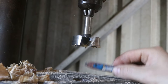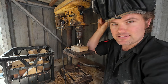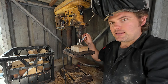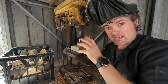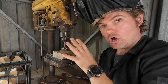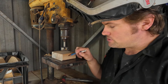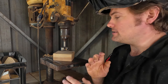We're over at the drill press now and this is a 50mm Forstner bit. I use this little spur to identify where the center is - where I need to get it smack bang in where I made that little mark with the template earlier on. One thing I want to quickly mention: I'm making a mortise with this Forstner bit to go on the VM90 chuck - the Vicmark chuck with the dovetail jaws. When you're chopping your blanks up, always look for faults where little cracks might be running up and down. When you expand those dovetail jaws inside the mortise it can become very vulnerable to splitting apart and flying across your workshop.